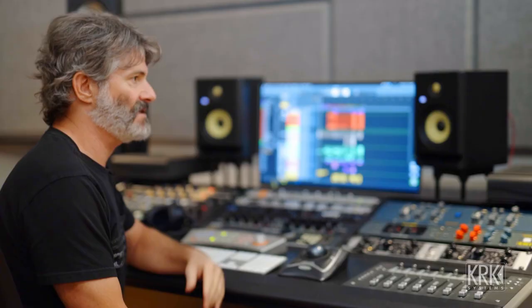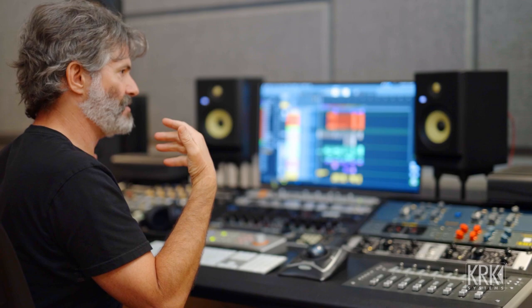So I don't have a bunch of sound coming directly back to me. It's balanced and cleaned up, but it sounds real world. It is a balanced space. Another key thing, if you can do this, is there's a cloud over my head. A cloud is the same type of absorptive material that's on the walls, but what it does is it keeps reflections from the ceiling from coming back down on me. I have this work surface in front of me, so I am going to get some reflection from the speaker off of this coming to me.